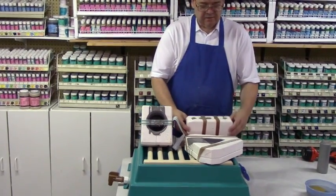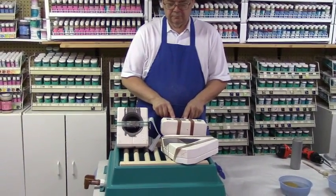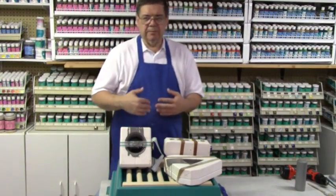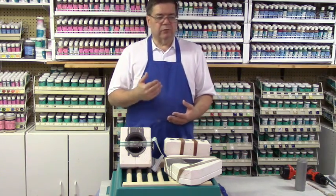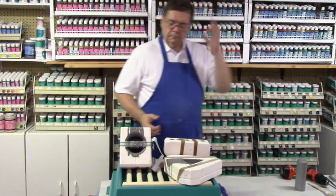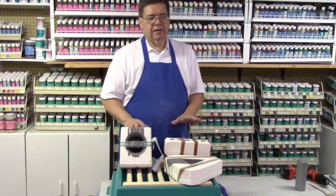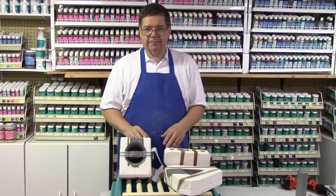As I said with the attachments, you can see it has set up to the point where it stopped shrinking, so I know these handles are now solid. That's pretty much the casting portion of this. The slip I've dumped out of the molds can be reused as long as you keep it in liquid form — you can take it out of your table and put it back in a bucket or in your pouring machine. Now these molds have to set up until they're what we call leather hard, and I'm going to show you what that means in the next step.